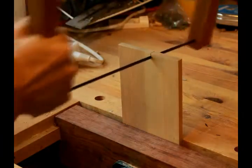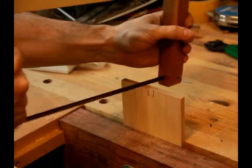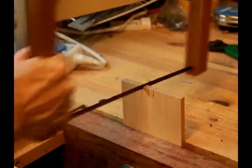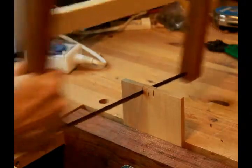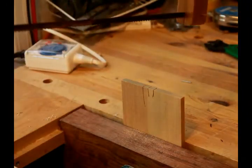It was time to give it a test run — and disaster. The blade busted. I wasn't sure whether I could use the same thin blade, so I wound up getting another old bandsaw blade that was a little bit thicker and put holes in that one. That went together a lot easier and I figured there would be more meat on it to hold the blade so it wouldn't crack — and I was right. Unfortunately it was a little too thick to make curved cuts, which I wanted to do, and the saw itself wasn't tracking straight. So I basically made a useless saw.